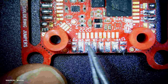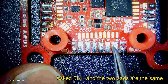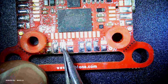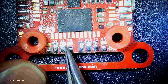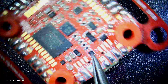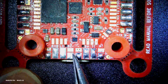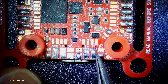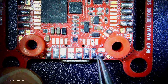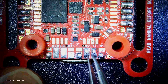I'm not too sure what these two pads right there are — I'll try to figure that out. For this one, you have the 5V, you have UART 5, and then you have UART 3 over here. That's fairly straightforward. And now here you have the buzzer, then you have UART 1 and 5V.